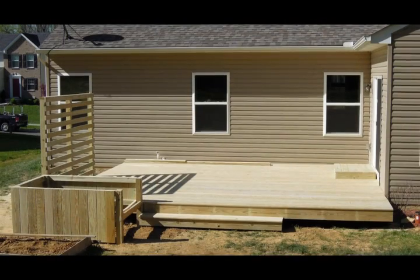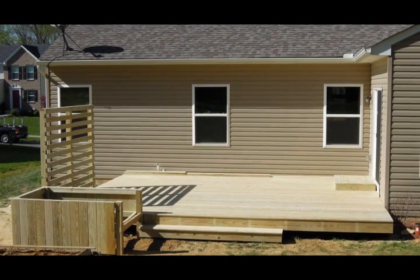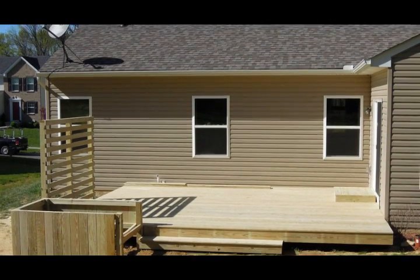There are three different types of deck you can build. There's a floating deck, which basically sits on patio stones or a deck block, so it's not actually dug into the ground with a footing. The only issue you could possibly get with this is that it's susceptible to ground movement and frost heave.